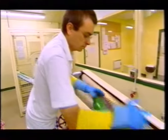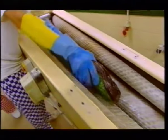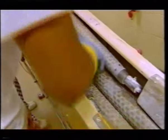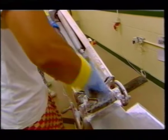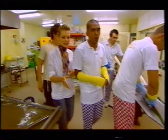We'll then pick up our big sweet and the sugar now goes to another bit of machinery — the batch roller. And this machine turns it into lots of different sweets. In this machinery we've got heated rollers as well, because we don't want the sugar to lose too much heat and go too hard before the sweets are made. The machine also thins the sugar down into a pencil-like shape, which is going to make it easy for us to get the sugar into different shapes and sizes for the sweets. So what does that look like when it's finally come out at the other end of this machine?